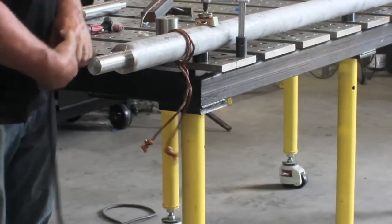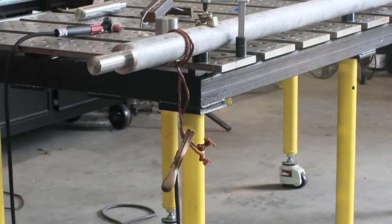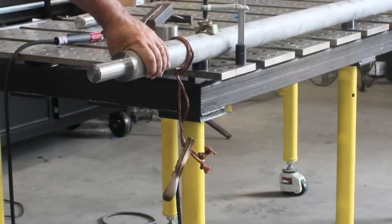This is a little trick for getting a ground on a round shaft. You might be doing this in pipe vise stands or somewhere it's hard to get a ground clamp on the part. Just wrapping some bare wire from some old scrap leads around it, then clamping the ground clamp to that, provides a really good ground that'll let it spin and everything.